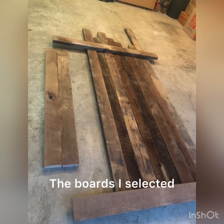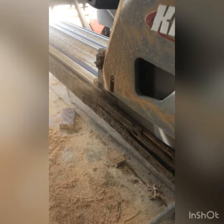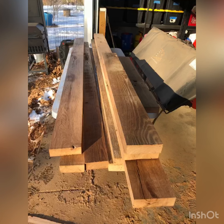Some of the boards were warped, twisted, and cupped, so I had to use the track saw to get a nice straight reference line. Then I went over and made a straight cut with the table saw to get everything nice and square. I also ran them through the planer — got them flat on the bottom side, then flipped the boards and got them skip planed, which left a lot of that good saw marks and character. Here I have all the boards oriented and laid out how I want them.